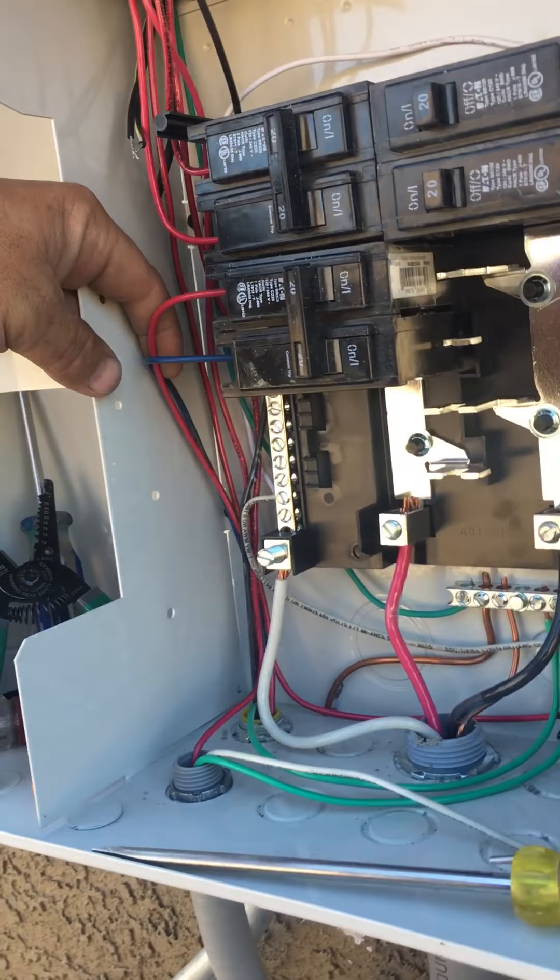It shows this if they ever read it — your power is supposed to be directly connected. As you can see, this power is still on the reel, the blue and the red, and it's directly straight into your breaker. That means your heater is going to be hot all the time — it's always going to be on. That's fine, that's how it's supposed to be.